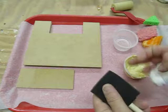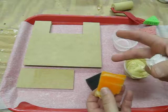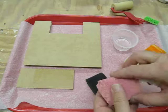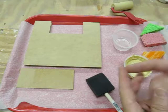All of these have been wet with water. Dip it in water and then use a paper towel to wring out all the excess — you only want it slightly damp. For a finer texture you can use an automotive sponge or a tile setter sponge, those large yellow sponges, and cut a piece off. A coarser texture like a regular kitchen cellulose sponge works well for a Spanish-style stucco, and you might cut different sizes depending on whether you need to get into small corners or edges and details.